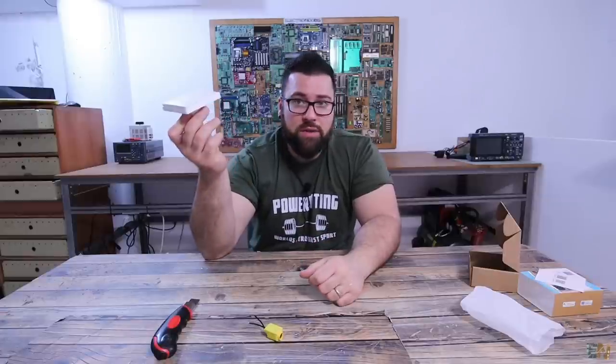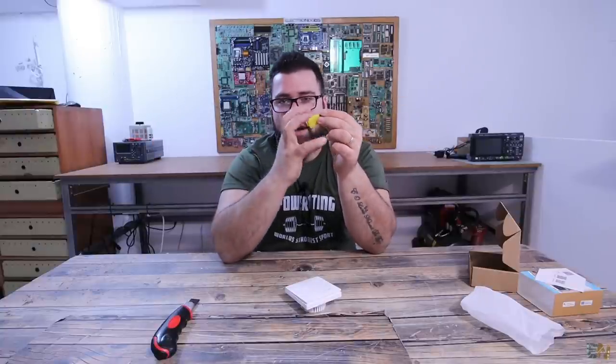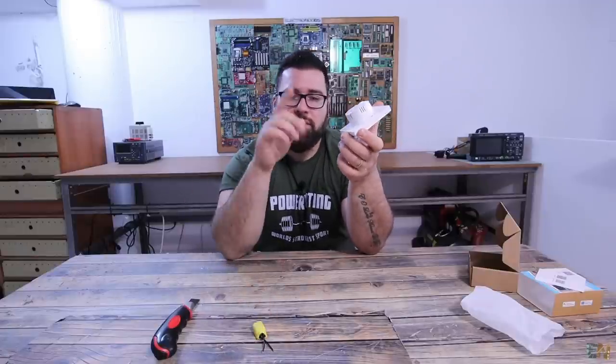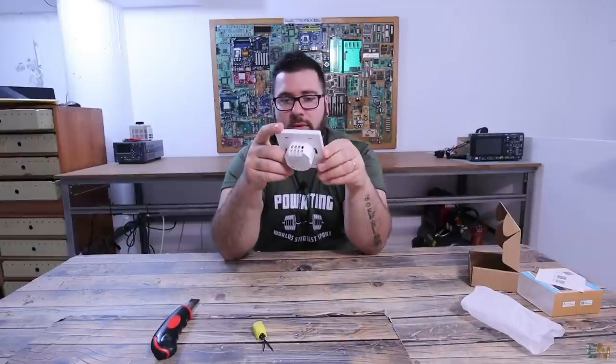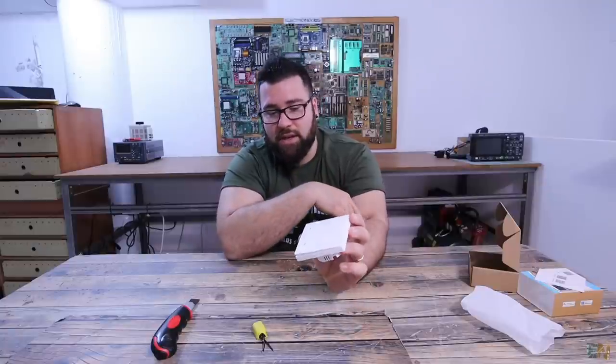So in order to power this without any external supply, you add a huge capacitor between the inputs of the load, which will be the light bulb here. So this will store just enough power to feed this one with 200 and something volts. You have a voltage regulator inside, and then it will create 5 volts for the ESP32 or some radio controller that it has inside. So let me just open it and show you what we have inside of this Wi-Fi controller.